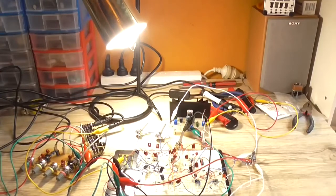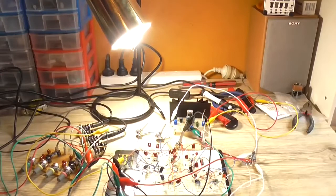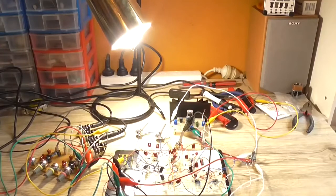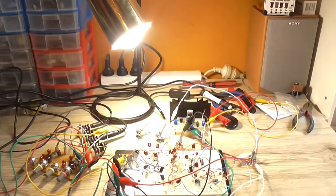So I'll just change this to the next one along. Like so. Right. Yes, that channel is working. Nice. Sounds alright. Need an equaliser. And I'll probably find that I will have to increase the gain of the summing amplifier to 3.1 to compensate for the levels. But also don't forget the power amp's not operating at its correct voltage either.